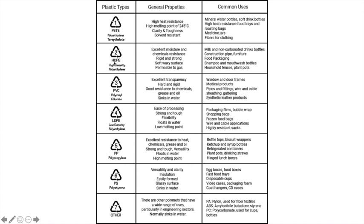polyethylene we were looking at, here's high density polyethylene and low density polyethylene. The high density one, it has a higher density and it's a harder plastic. And it's used for like milk cartons and things like that. And the low density, that's for like bubble wrap and things like that. And that one is, actually the polymer chains, they're not just linear chains, they have branches and the branches can attach to another chain. And the low density polyethylene has more branches so that molecules can't get closer. They're not as dense and it's more flexible. It's interesting. We got polypropylene, that was part of the beginning too. That's another common one. Polystyrene and some others, yeah.